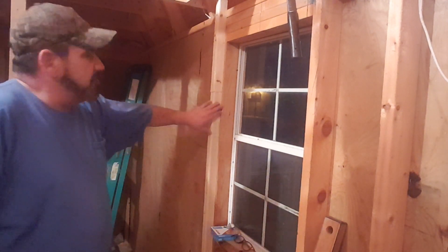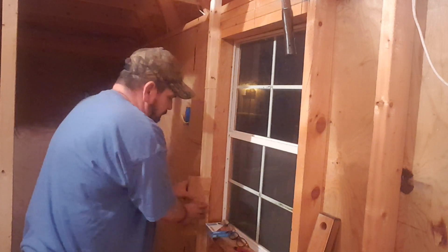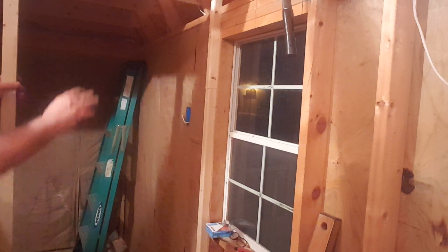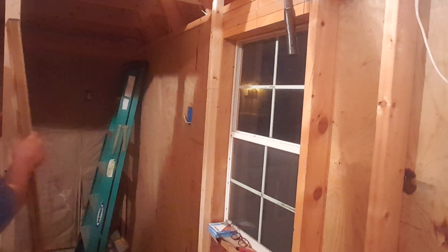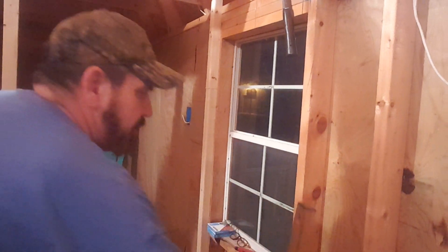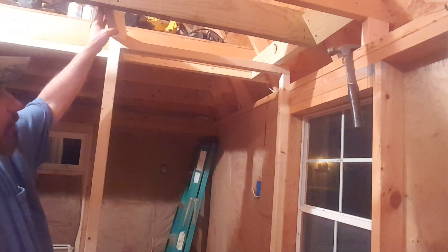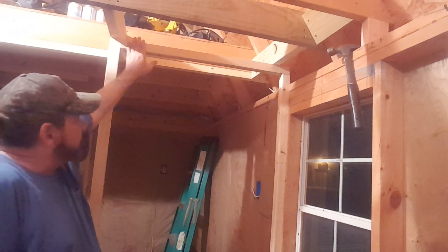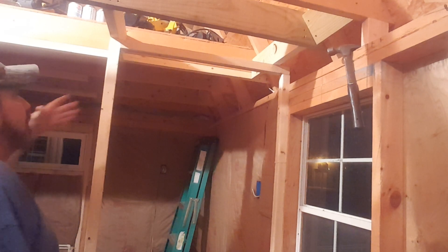Just like that I started on this wall. Basically, I had to make it so when I put my foot down I come flush with this edge, and I got all of that perfect all the way down — everything's level. There's that wall, up to there. I had to put in a couple of braces to hold it and I still have to put a two-by-four up here on top, like I did over there, for me to nail the ceiling to.